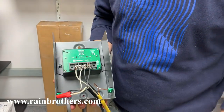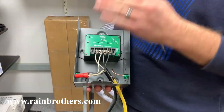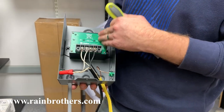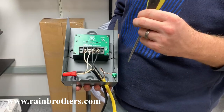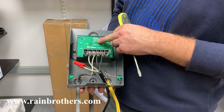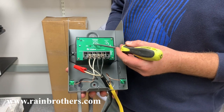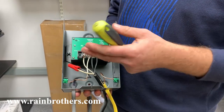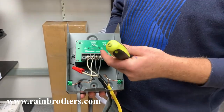To start up the Pump Saver, you're going to want to make sure that there is water in your well. You need to have water in the well so that it reads the load of that pump when there's water present. So you're going to wire it in, make sure that you have water in your well, and then this Pump Saver comes already dialed to calibrate — CAL. You're going to energize the system and it will go through a calibration mode. It only takes a few seconds.